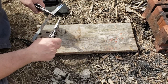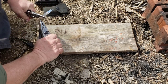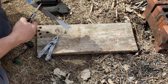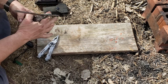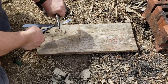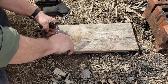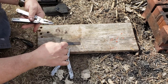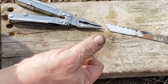You can take another pair of pliers if you like. What you're doing is working it back and forth to weaken the steel. As it gets weaker, you'll feel it starting to give up. Putting it in a vise or something like that is a lot easier — there it goes. Sometimes you don't have access to stuff like that; this is the easy way to do it. When you break it like that, it leaves a burr, which is exactly what you want on the end.